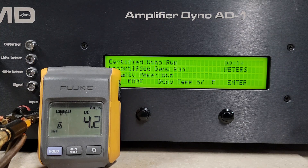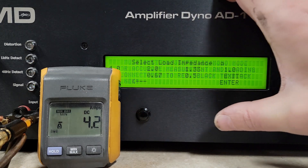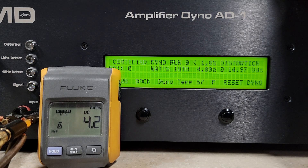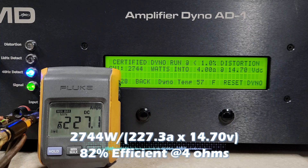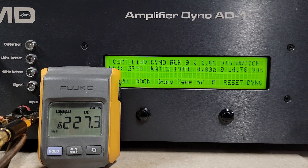One quick thing to note: in my preliminary testing I gave it one uncertified run at 2 ohms just to see what it does — I don't think it clipped. We're going to start certified at 4 ohms. I don't remember if the website had a 4 ohm rating, but we'll find out. We're at 14.97 volts — here we go, the Bully 5000 at 4 ohms. No clipping — we got 2,744 watts, dropping to 14.7 volts.